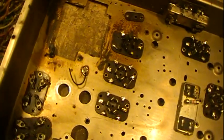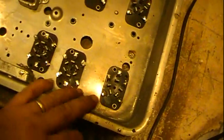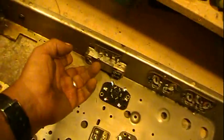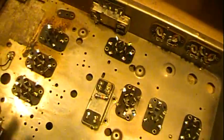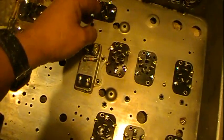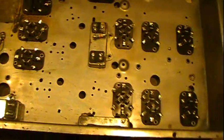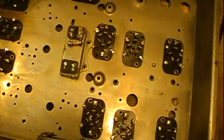It doesn't warrant painting it. The underside got some discoloration from the power transformer. Other than that, we'll have to unrivet these — these are your caps, basically paper caps. I'll have to take these out, and then on the bottom side there's a plate that's soldered into place. You just heat it up, the plate comes off, and then you can remove the capacitors and fit in new ones. Otherwise it's just stripped down clean.